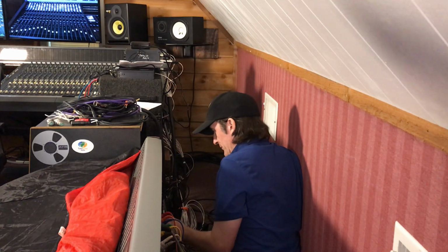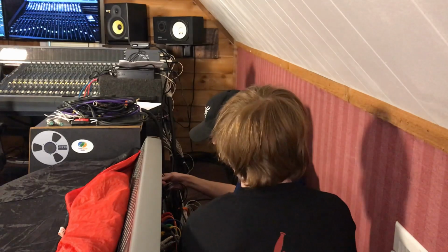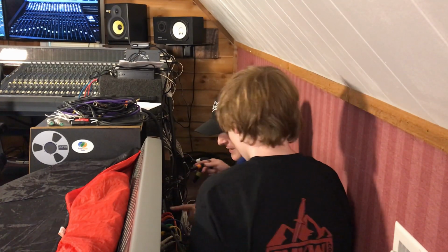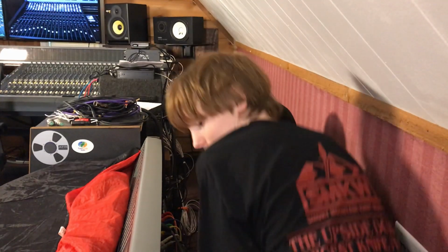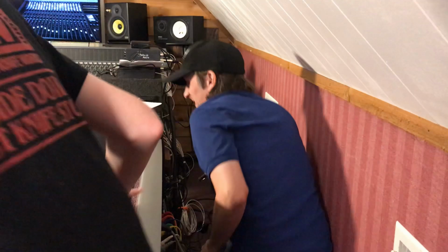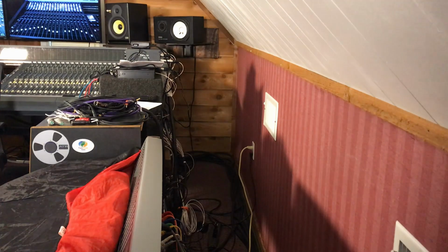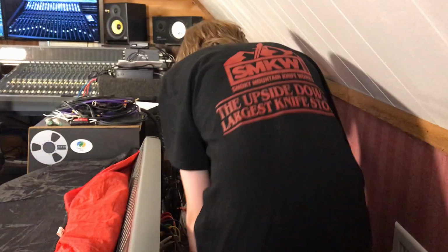Sure. There you go. Well, you come back here and do it if you want to. Okay, you're just going to plug in the same color order, orange, yellow, white, blue, from 5 to 8, and plug them into the rest of this row. Okay. Yeah, my knees are getting too old. Here you go. You can go. I'm going to let Gary help do this. Ow.